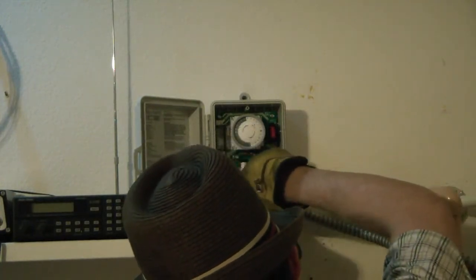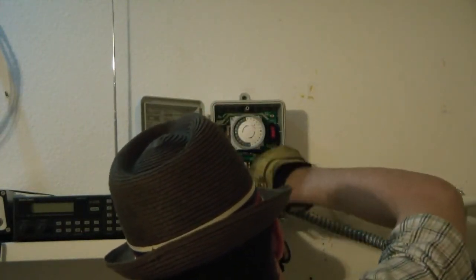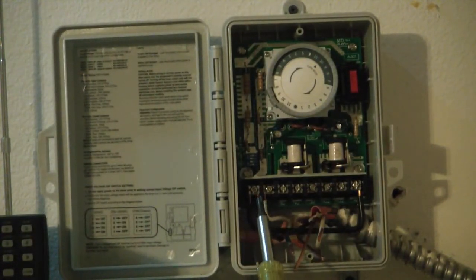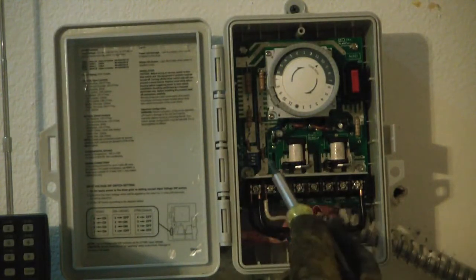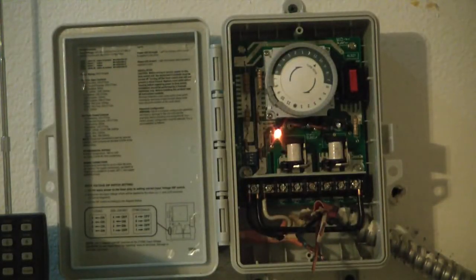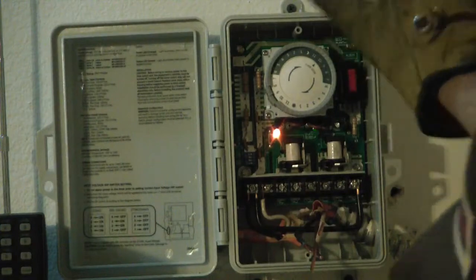Got some thick wire. Essentially, all I did so far is hook up the power from the breaker into the line in here, and that's on the left hand side. I flipped the dip switches, which show on the panel here, so it's set for 220 to 240. I'm going to turn on the breaker — the actual hot water heater line is pulled through but it's not hooked up as you can see. I flip on the switch and you can see I get a light, so we know at least that's working. I should be able to flip this and see the timer come on. There it is — I heard the relays kick on. So far, so good. I'm going to go ahead and shut the breaker off, and now we're going to figure out the pinout for the actual hot water heater hookup.